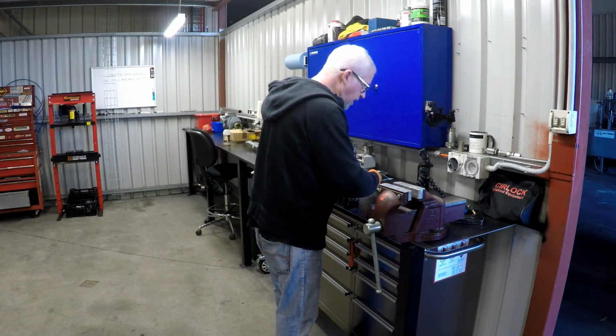All right, so we're going to press him on now. Why press him and not bash him? Brinelling, in short. What is Brinelling, you may ask? Think about Brinell and the hardness scale. What happens is when you hit a bearing with a blow, it can shock and put very tiny dints in the surface of the race or flatten the roller slightly, and that will begin premature wear. So it's better to put a constant force and just press it together.